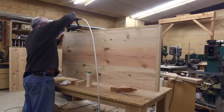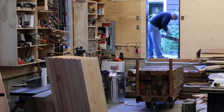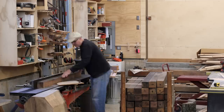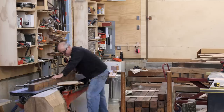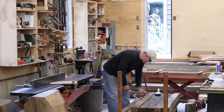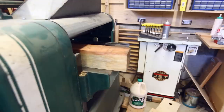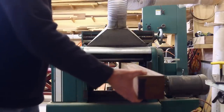For the tables it was basically the same — the sides were just wider. For the legs, I got them at the same place: dunnage wood for steel when it's shipped in to the port here. When steel is shipped it has to sit on something, so they cut up this beautiful tropical hardwood — dense enough that it won't crush under the weight of the steel. It's really nice to be able to reuse this, and it comes in a form that's almost the shape I need for the legs. I jointed two faces to get the piece square and flat, then planed the other two faces.